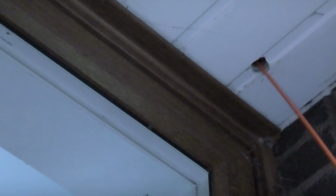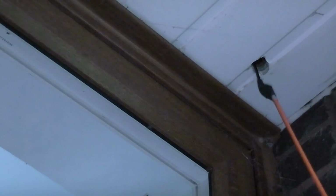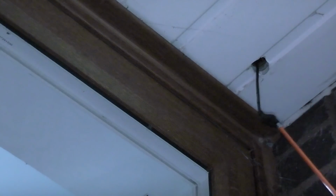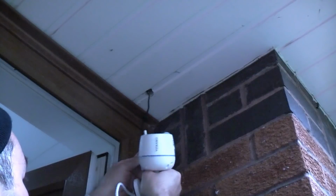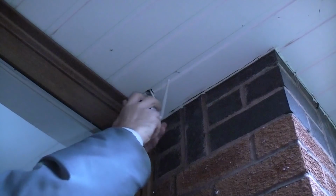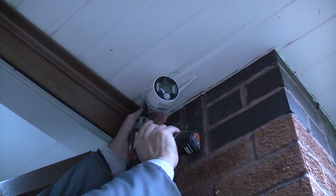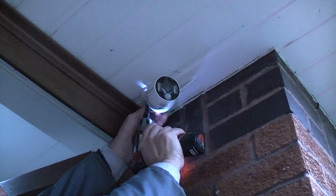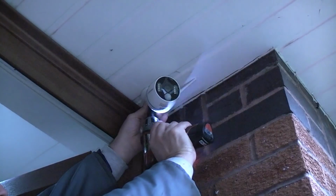You only need to connect to the RJ45 socket if you are connecting this camera to a NVR. But for Wi-Fi, you only need the power connector. The tape can now be removed and the camera can be plugged in. We can now screw the camera to the socket board. I have added all 3 screws loosely using the drill driver, but we'll do the final tightening by hand.